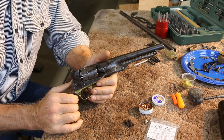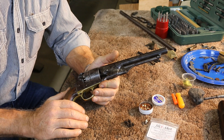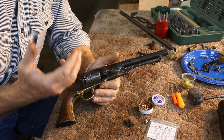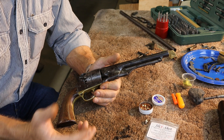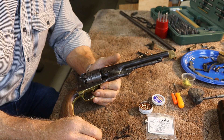We've got this cylinder all scrubbed up and cleaned up as best we can, and spent a lot of time cleaning the bore. It needed it, but it's got a surprisingly strong bore and strong rifling. There's still a little corrosion in the grooves and we're still going to keep working on that. We're kind of right down to brass tacks — we just have one more thing to do before we take this out and test fire, and that was to change out the nipples. These original nipples were just corroded enough that they weren't holding the caps on very well, and we don't want caps falling off while we're firing.